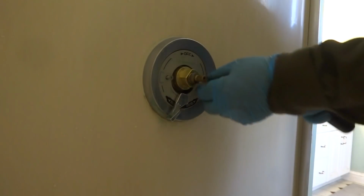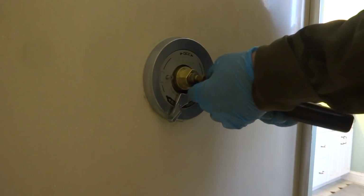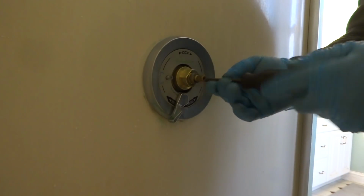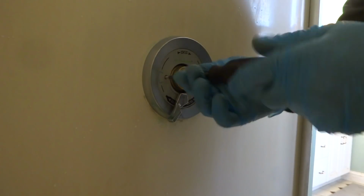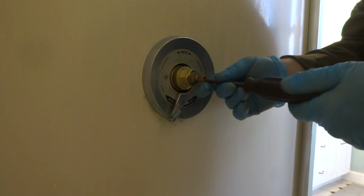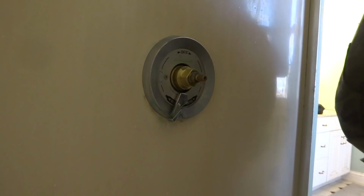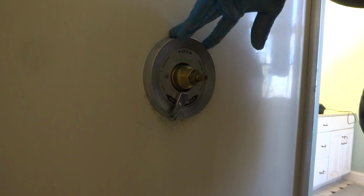I worked on tub showers and the homeowner's up there operating it while I'm downstairs looking, and come to find out it was something that would have been simple if I would have gone up there to look at it, instead of the homeowner saying, oh, I'll go turn the water on for you while you can see the leak. So sometimes the homeowner getting involved makes it worse to find the issue. Rip the guy's whole ceiling apart and everything downstairs. It was a real bad leak. Come to find out, when he had one of those personal shower things up top, the hose was spraying right down onto the mixing valve.